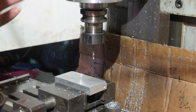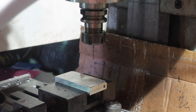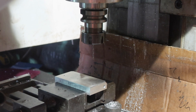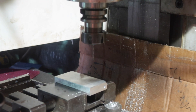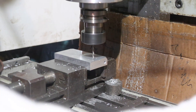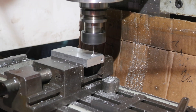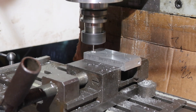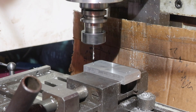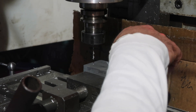We're now going to re-drill these holes to two and a half millimetres, and we're nearly done. I need to mark them and I need to chamfer. Double check — oh yes, nice fit. Very nice fit.